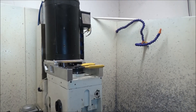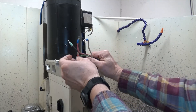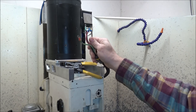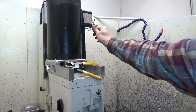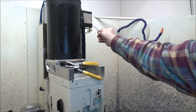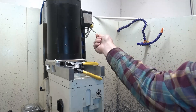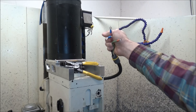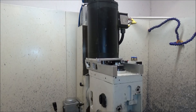I've got the motor mounted, belt tensioned, and now I'm starting to wire it up. With the Leeson motor I had put terminal ends on because it had studs and nuts to secure the wiring, but this Marathon motor just has wires. It's wired up for 230 volt versus 460: four, five, and six tied together, then two and eight, one and seven, and three and nine tied together — your typical low voltage setup. I'll secure that with wire nuts.